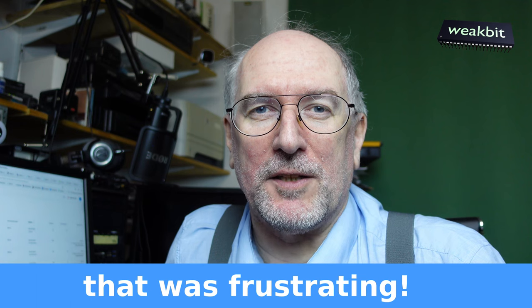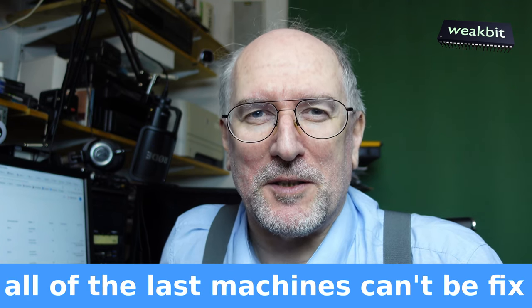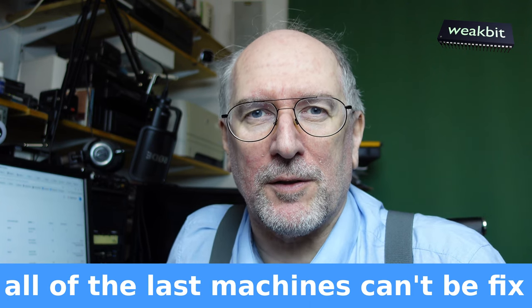What shall I say about the laser device from the Sony MDS-JE510? It's complicated to understand, and sometimes no data is coming down, and sometimes data is coming down. I could load it for a half second or a second, and the lowest error rate was 100, and it should be under 20 for a perfect result, but it never reached 20 or under. Having 100, 200, 300, 400, this was the lowest, but that was yesterday, and today it doesn't work anymore. So I think the laser light is dropping down, or you can align it higher and lower. No energy is on the laser beam. Also the high should be very intensive, but it's not. It's poor. It's really poor.